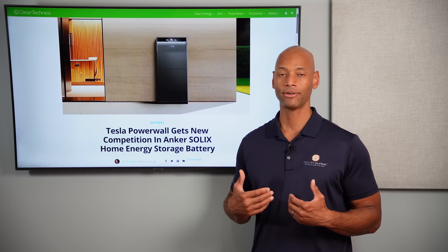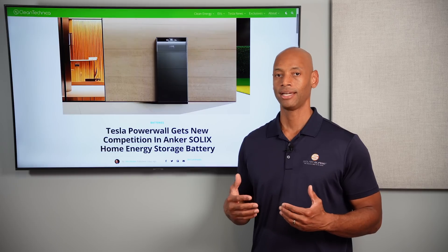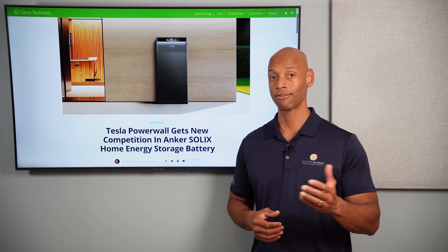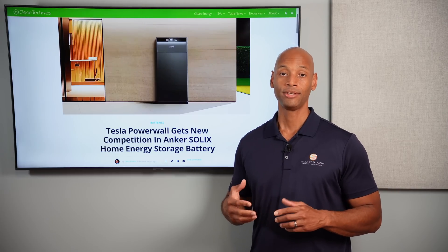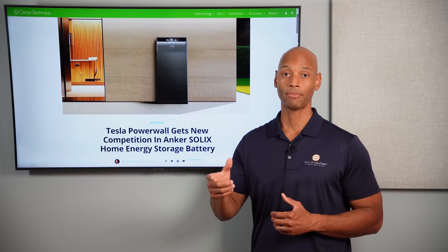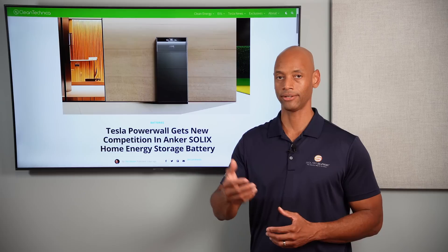It's hard to imagine, as a licensed electrician and contractor of many years, because hooking this type of battery up to a solar system means handling high-voltage, high-amp connections — not really work a typical homeowner would undertake. And realistically, if you want something permitted and inspected with a net metering interconnection agreement with the power company, that work typically must be done by a licensed electrician and inspected by your local AHJ — your local city or county government.